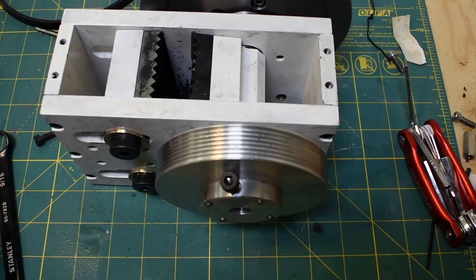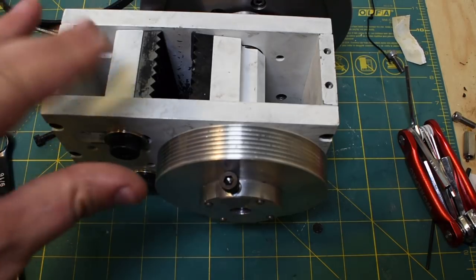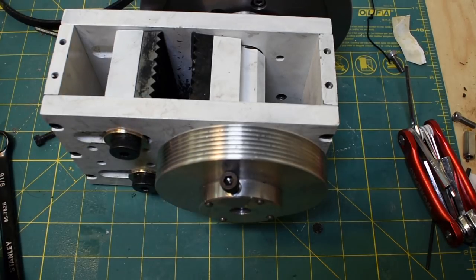One commenter, his name is Turning Point, actually has experience with full-size crushers, and he mentioned to me that I'm probably running too fast and that's why the rocks are shooting out everywhere. It took me a little bit of time to get my head around, but when I was designing, I was basically thinking, you don't have torque, so you've got to have speed, so, you know, more crunches per minute or whatever will break the rocks as well. But there's a fatal flaw with that thinking, and it actually brings up a really interesting point.